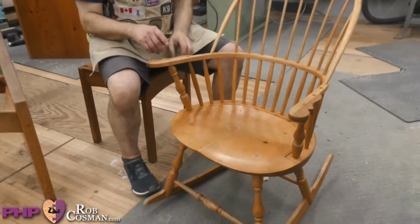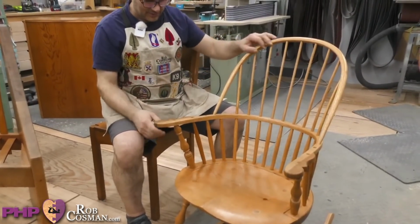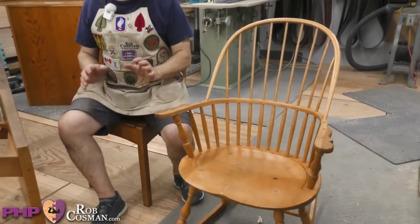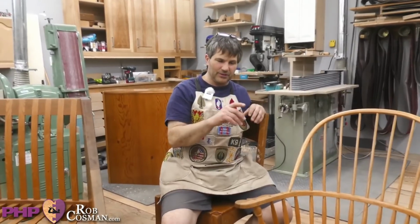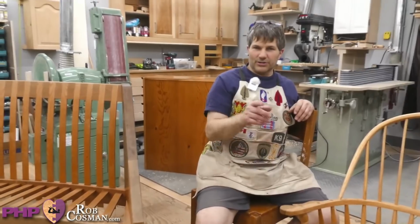You get anything with some squirrely grain in it, and those little short fibers don't have a lot of resilience, and if they get stressed, they're probably going to break or crack. So I hope that helps. I think when it comes to chair building, the straighter the grain, the better. That's where you want to stay away from the figured stuff, because what you get in beauty, you sacrifice in strength, and you need it in a chair. You don't want somebody sitting in your chair and collapsing it. Terribly hard on the ego. Yours and theirs. Next, Frick.